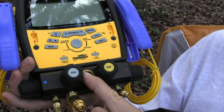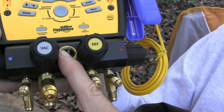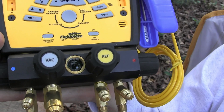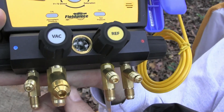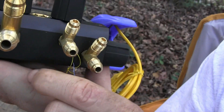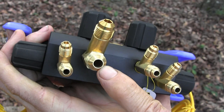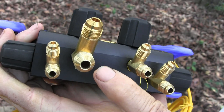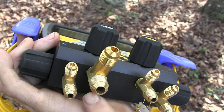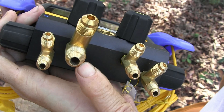Because that means you can connect your vacuum pump to it and vacuum any non-condensibles throughout the system, without ever disconnecting it or flipping hoses around to add the refrigerant. Take a look at the port here on the vacuum side — that is a 3/8 inch port. Beautiful idea. Having a 3/8 inch vacuum port means you'll be able to bring the system down into a tight vacuum easier and faster.